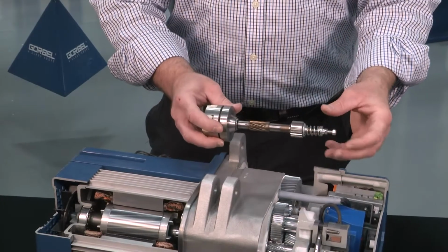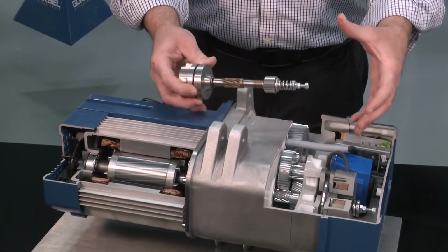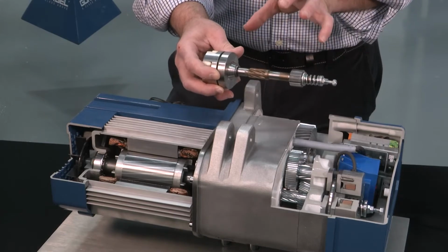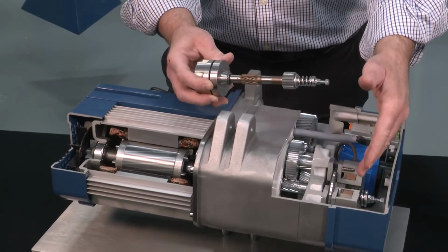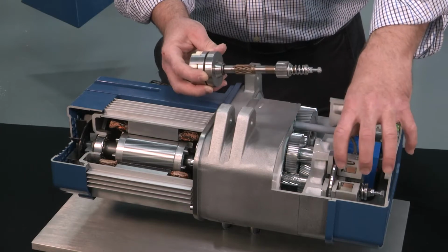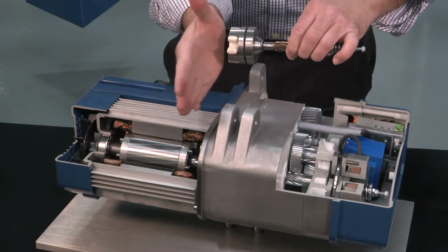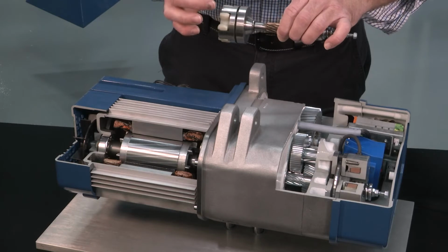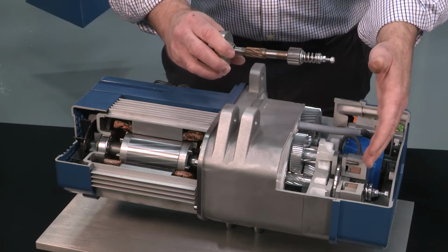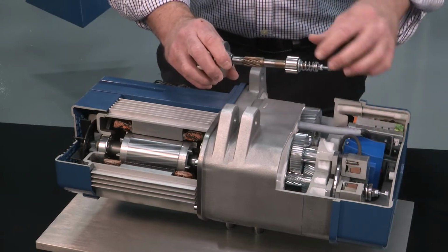So one thing I want to talk about while we're still on the front side of the hoist is the brake design, which is an innovation in the manufacture of the GS hoist. This was manufactured decades ago, and you'll see this in more modern hoists, but this is the hoist that's had it the longest and that first had this feature, which is the brake being on the load side of the equation. So with this brake on the gear train or load side, it doesn't matter what happens to your motor. Your motor could stop, anything could happen, and this might otherwise result in a load drop if the brake were mounted to the motor side, but since it's on the gear train side, anything that would happen with your clutch or your motor is protected by the brake being on this side. So it's an important safety feature.